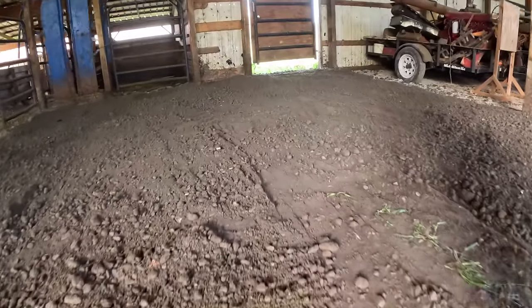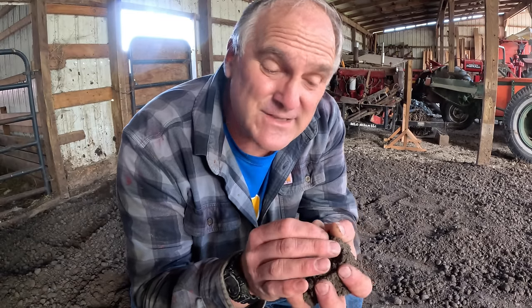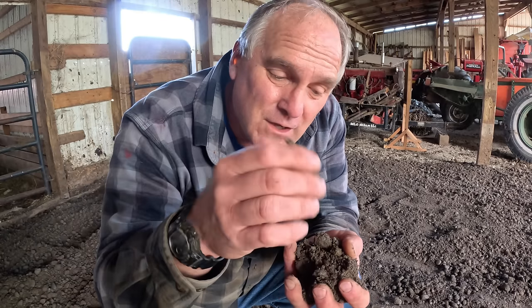Getting better. The basics of fill. This fill is a graded mixture of fine, clay and silt are fine, all the way up through little stones. And when you have a mixture like this, it compacts. I can squeeze it with my hands. So if you ever use fill like this, you have to compact it, or else it's going to settle on its own, and it'll settle irregularly.